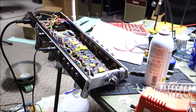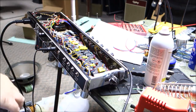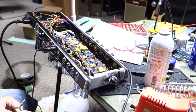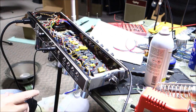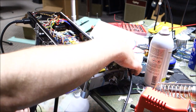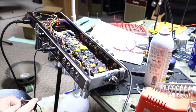And then I'm taking a break and going to the auction. All right, so let's pick an input here. Click. So we're in. And here's where all the smoke comes when we take it off of standby. And nothing happened. Turn it up a little bit. Okay, I hear a lot of buzzing in the tubes. I can hear the tubes buzzing in the amplifier, but I can't hear my speaker. So is my speaker messed up, or is it disconnected? Let's find out.